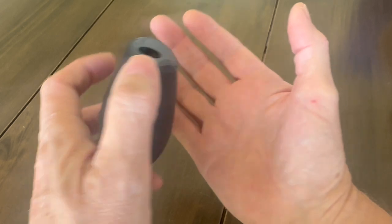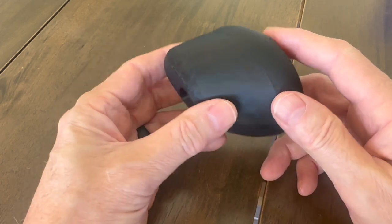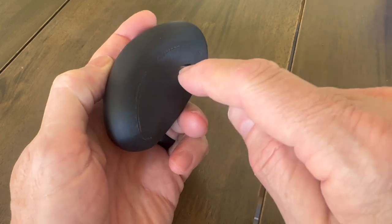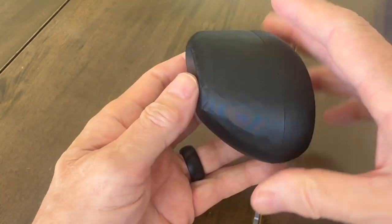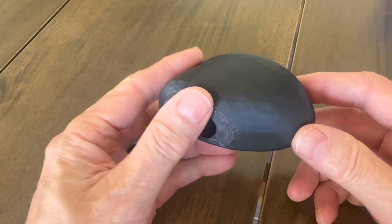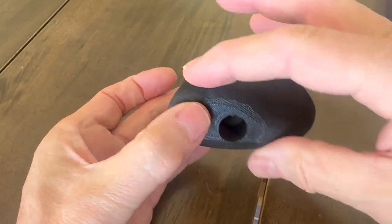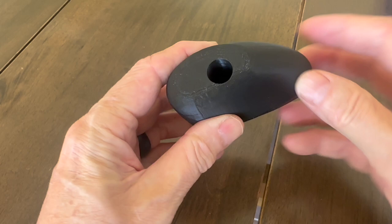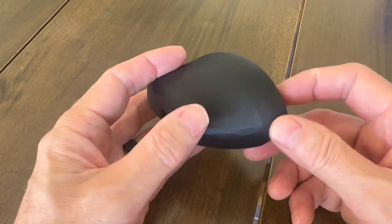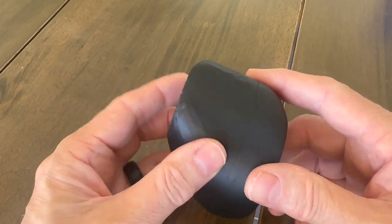Here's the draft PLA plastic handle that I made, just trying it out in my hand to see what it feels like. This is just the draft — I haven't got the end cap in it, but that's the side the nut goes in, and there's a bolt in that side. I've temporarily glued it together so it doesn't skew around. Since it sits on the throttle arm, the round nut could rotate, so I've added provision for a roll pin to sit in beneath the nut, and another one in the back so the two halves don't move around independently.